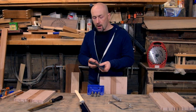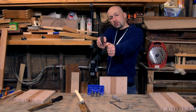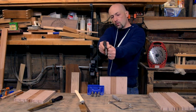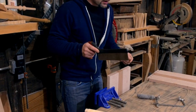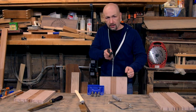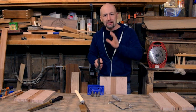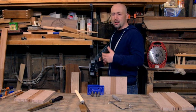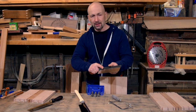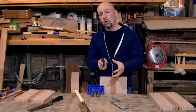When you're using this type of saw, you're going to want to take a particular stance. You essentially want to turn perpendicular to the piece, and you want to draw the saw back almost like you were drawing back an arrow and a bow. The reason for that is you want the saw to clear your chest. If you were sitting over the piece trying to make the cut, you're going to end up rocking as your hand clears your chest, and this can cause a gap that wouldn't otherwise happen. It's also just less ergonomic. If you take that wide stance drawing back, you're not going to tire as quickly. Another important point is you're going to want to hold the piece sort of like a pistol grip, with your index finger extended over this part of the saw — it's going to give you control as you start your cut.